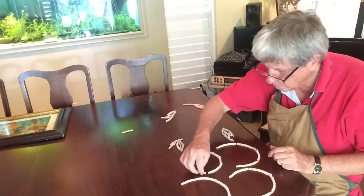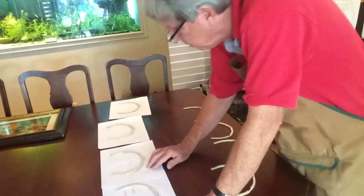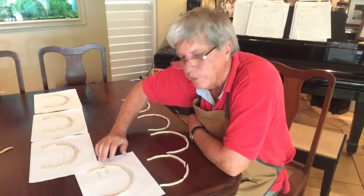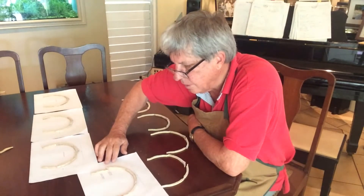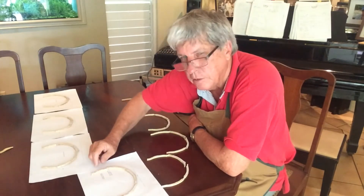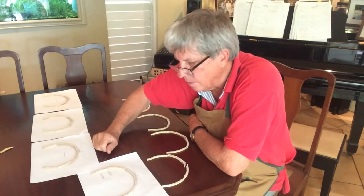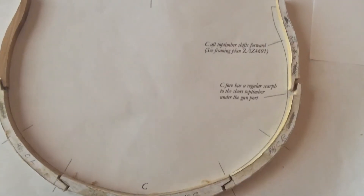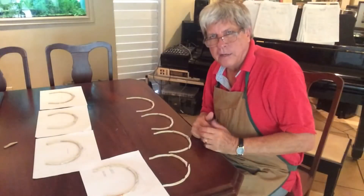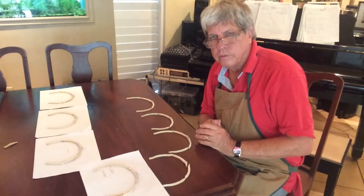Then finally we assemble everything, and of course you need to check those against the sheets — the extra sheet that we left out which we use to assemble the pieces. When we stick them, the only frame that is going to have a change is the aft, where the top timber on frame C shifts forward. So again we just need to look at the plan to make sure we get that right. So let's get back into the inner shop and start assembling these frames using chocks wherever possible.